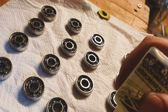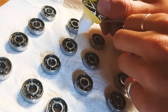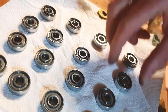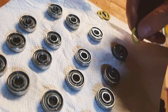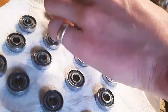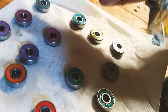I just need a few drops of oil on each side and I'll work through them in a logical order. I'm going to flip them over onto the other side — most of the oil should have got through, but I'm just going to put a couple of drops on this side just to make sure that everything in there has got a nice even coating. They sound pretty good. These covers should just pop right on — they do have a side: one's got metal on it, one's got rubber. We got all the bearings with their rubber covers back on, though a couple of them still aren't sounding too hot.